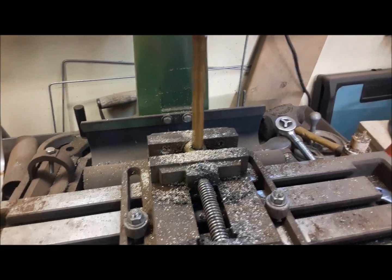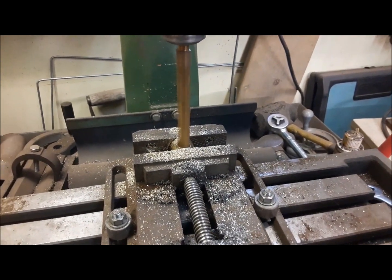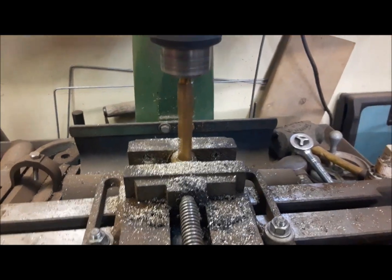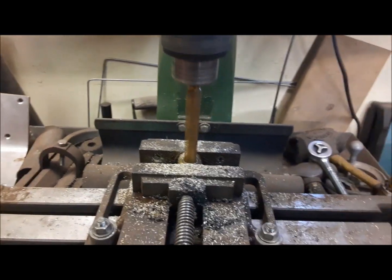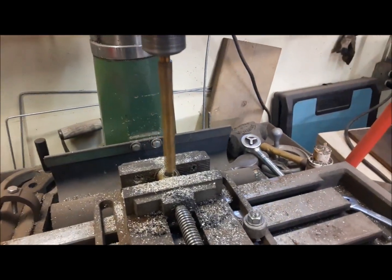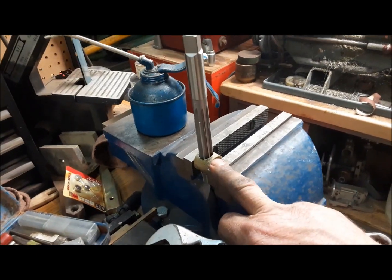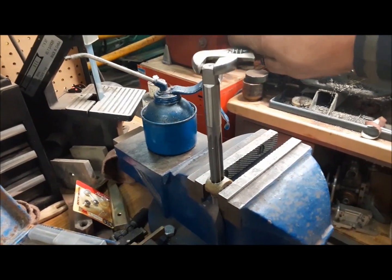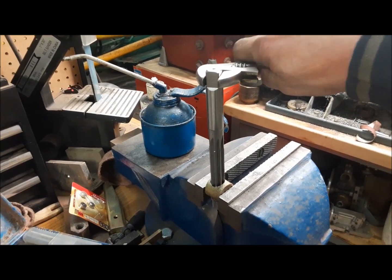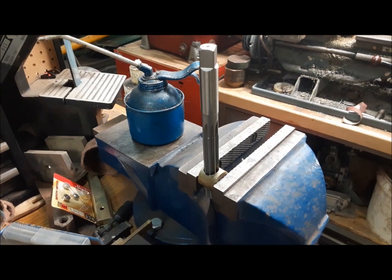First thing we go through with is a 1/2-inch drill. That just gets rid of the threads and straightens it all up. It'd be the cat's ass to go through this with an end mill rather than drill bits, but I haven't got any that big. Once it's cooled off, we just run this 5/8 reamer through it by hand to get the hole exactly perfect. And then we'll carry on. We'll make up another insert and do just like we did on the other one.